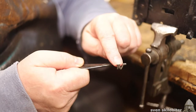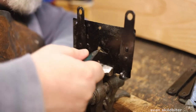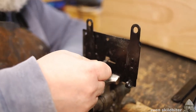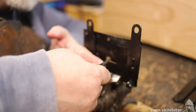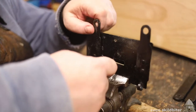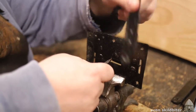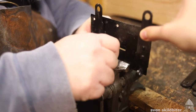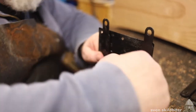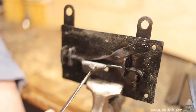There's a snib and only one tooth, so the key goes through the rectangular lock plate and the snib goes into a hole in the slide. The key rotates and pulls the spring up out of the way, and it just slides — and that's unlocked. And going back the other way, just slide it forward and the key comes out, so that's locked.